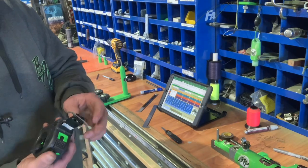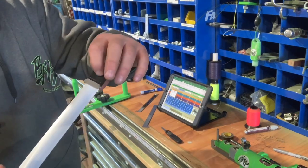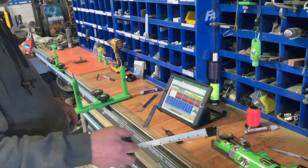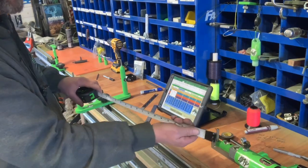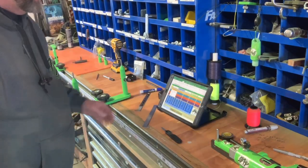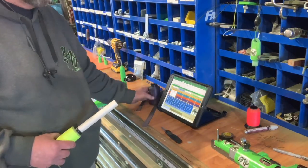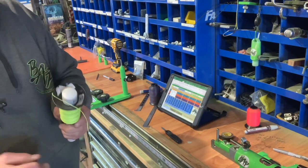This is my design, this tape measure. The hook plate on the end, they install them with electrical tape, but they work good for hooking over things. When you get out 80 inches, it's kind of a pain when you're trying to hook them on this way, they keep falling off. So I'm going to lay out a little gizmo I came up with the other day. This is just a piece of half inch PVC.